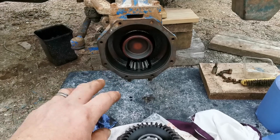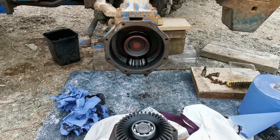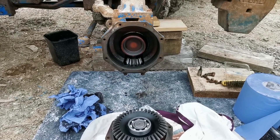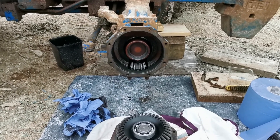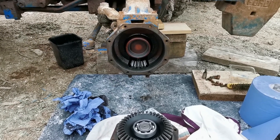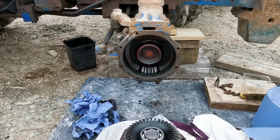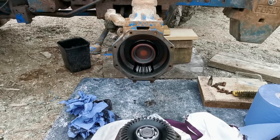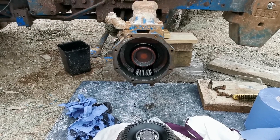All I'm going to do is lift that up, bolt it in, and refill it. The manual specifies Ford 134 oil, which is a very difficult standard to identify. Having spoken to a few people, I think EP 90 GL-4 and GL-5 standard is what's going in here. It should be changed every 300 hours — judging by what came out, it may not have been changed in 3,000 hours. I'm also going to change the oil in the other drop spindle and reduction gear so the whole lot is fresh, which will probably cause the other seal to go — but it's a 35-year-old tractor, so I'm reasonably happy with that.